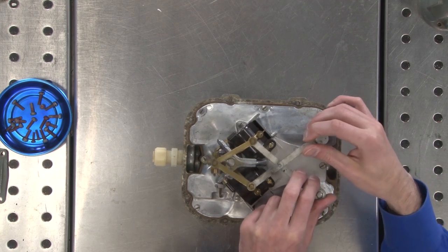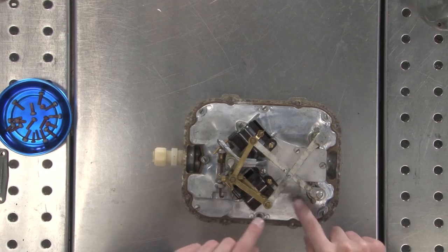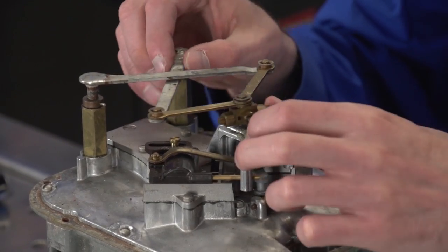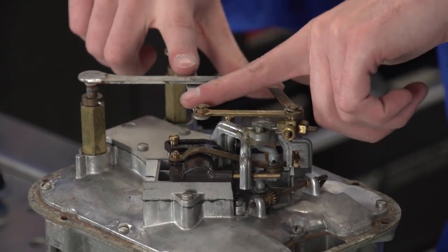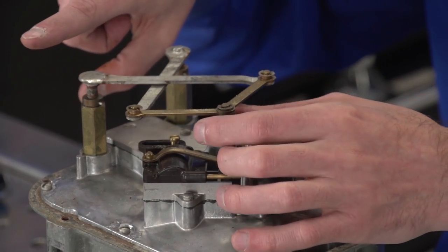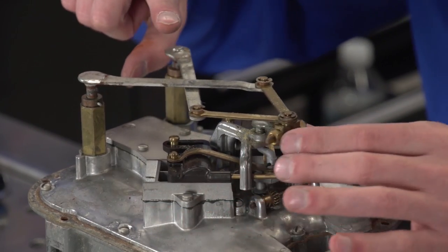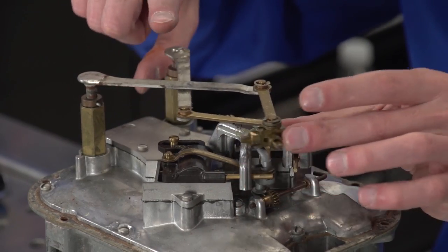And if you look, all right, this is a crank operated by something down there, and this outputs a linear motion. Okay, if you look at it, it sweeps one way and it sweeps the other. Just ignore everything else and look just at this bar, because this is where the power is coming from, okay? So first the bar turns this way, and then it stops right there. That's its apex. And then it turns this way, and then it stops. And that's all that bar is doing. It's turning that way and then back.